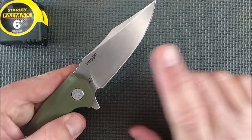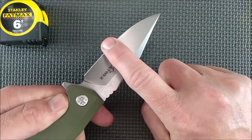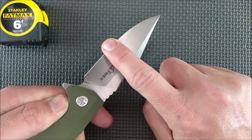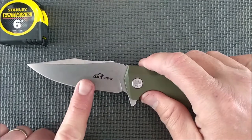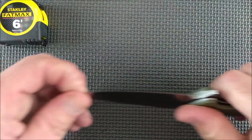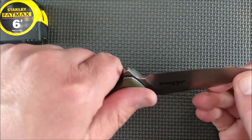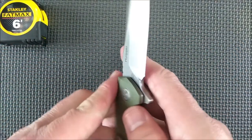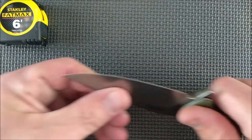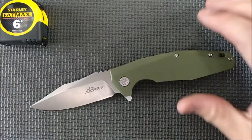The grind angles are 18.8 degrees on one side and 22.6 degrees on the opposite side. This side where it says Ultra X is 18 — that side is lesser. It's that perennial issue of hand sharpening a knife — people sharpen differently when they switch hands going across, because your dominant hand is different than your other hand.